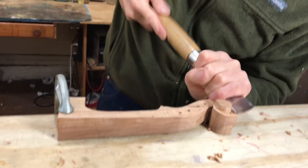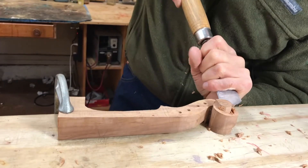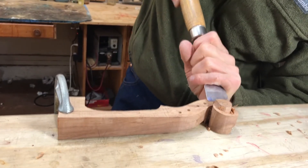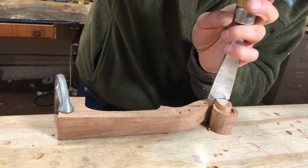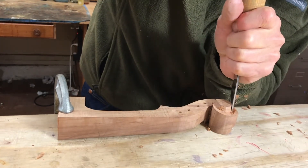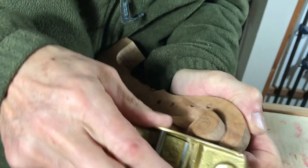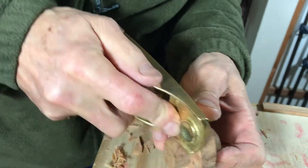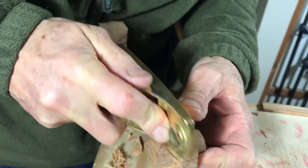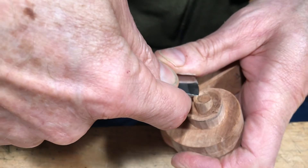I use my broad flat arching gouge to start with — it cleans up the sides of the peg box and I can remove a lot of material quickly while the work is still rough. Then later when I get into the tight spiral I'll start using smaller gouges. Cleaning up the front profile. These curves are caused by the intersection of a flat plane with a curved surface, and you get these complex lines that look different from every angle.